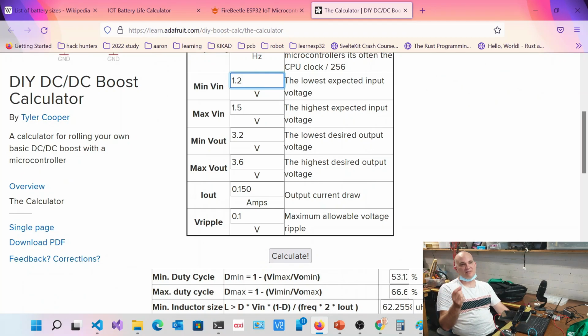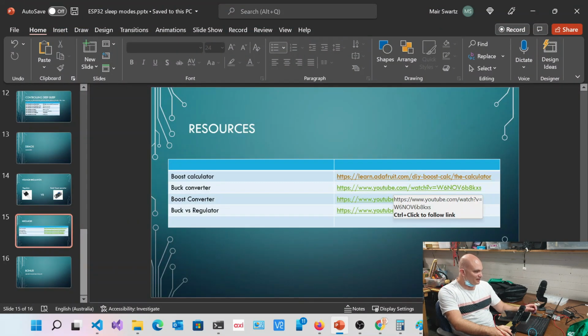The other thing is with a regulator, you've got at least a 1 volt voltage drop across it. So if you've got a 3.3, you've always got to be at least 4.4 or something like that, which means as your battery goes below 3.7, you lose it. So something else to keep in mind. Do voltage regulators stop functioning straight away, or do they glitch? They glitch, especially if you don't have a heatsink on them. If they're consuming a lot of power, they overheat and switch off, and switch on, and switch off, and switch on.